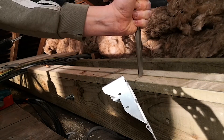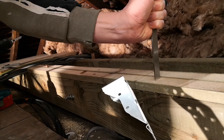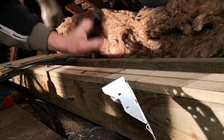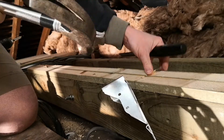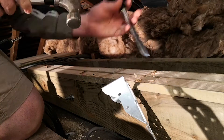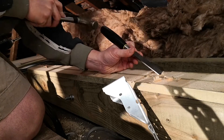Next up, you can see that I've added some battens to the top of the two sister joists, and I'm just getting ready to notch out a small area for the joist hangers for the trimmer that's going to run parallel with the longer side of the hatch. So I'm just marking out with a chisel where the metal part of the hanger will be bent over and secured down.